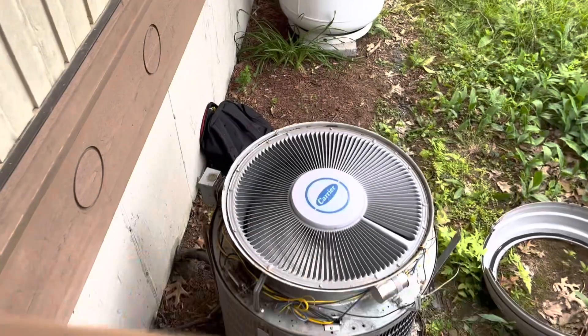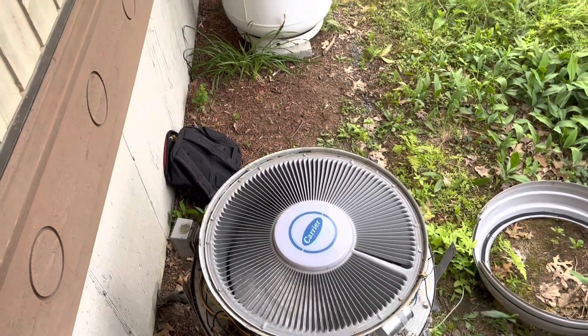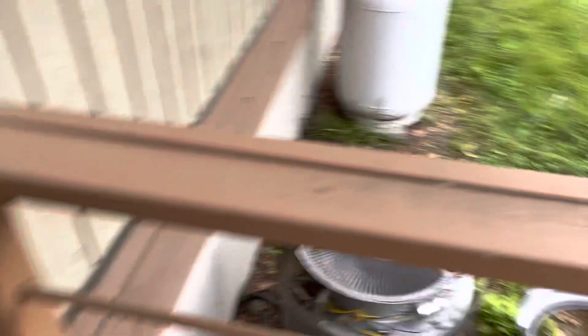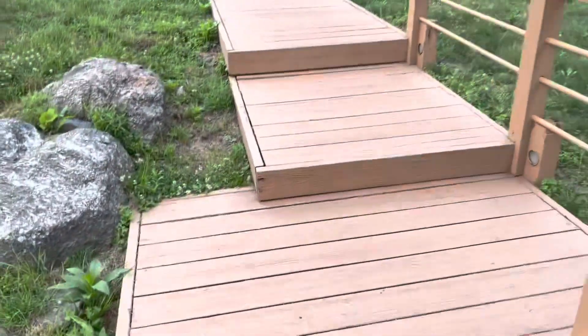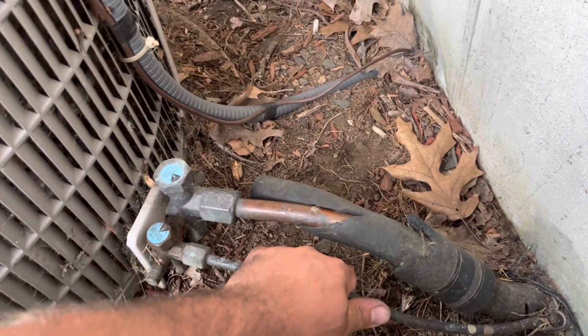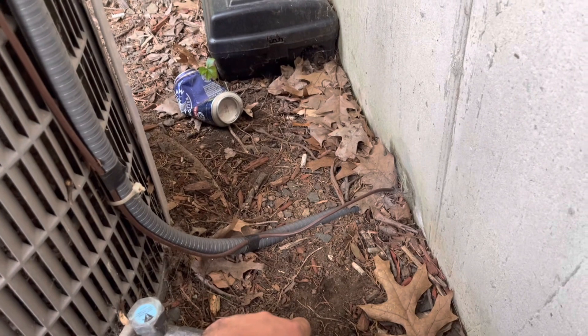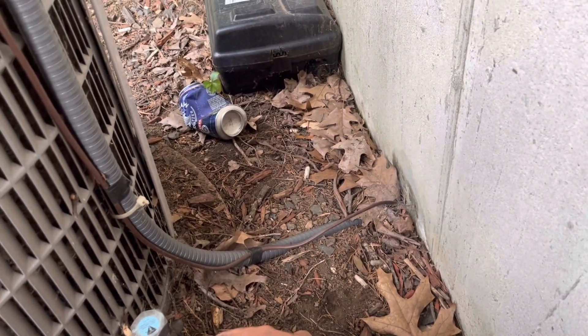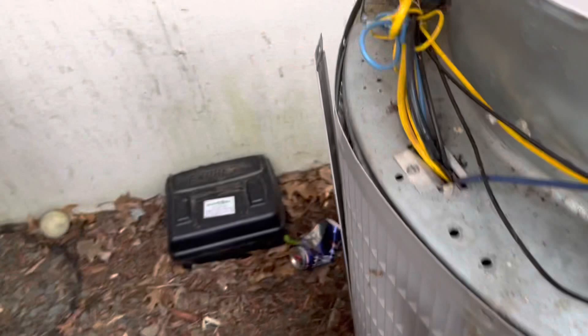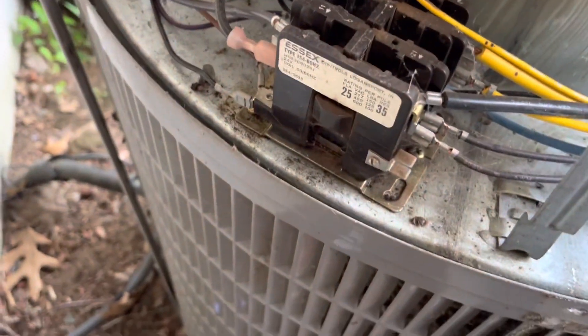Better sound than before. I don't think I hear the compressor kicking on — actually I don't hear the compressor. Maybe you're not supposed to hear the compressor on these. But it's starting to get cold. This is a high heat load in that house, and it's dirty too — not hot but it's warm. Let me let this thing run for a while and then I'll take my temperature split. I hope I don't have to start diagnosing a compressor. Look at this old contactor — it's moving heat though.